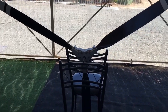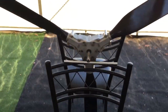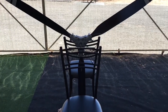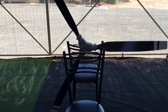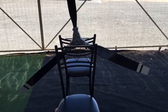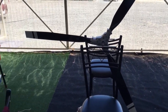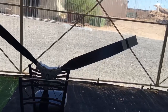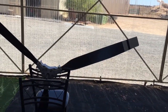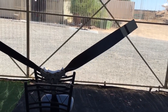I've been at this for quite a while now. I simply sit each propeller blade down at the bottom and let it do its thing. I've done it at least ten times and it always stops in the same place. It tells me that this lower blade coming down is the heavy blade, the one up here with the sticker is a little bit lighter, and this blade here is quite a lot lighter.